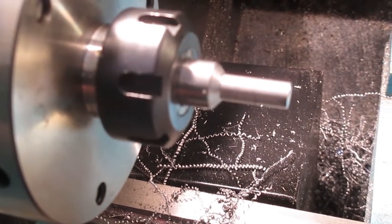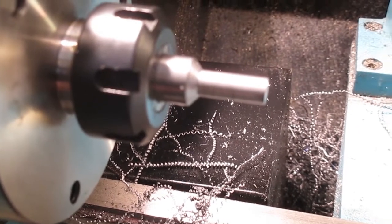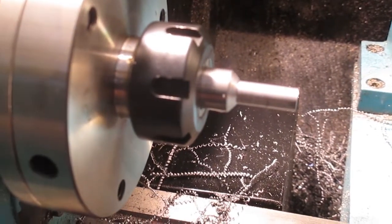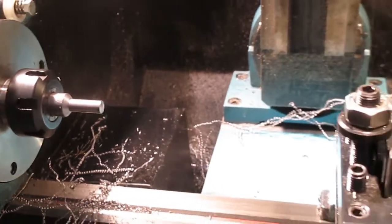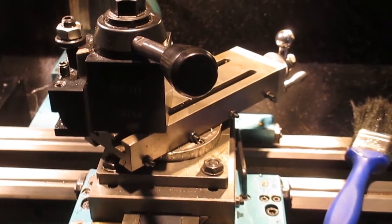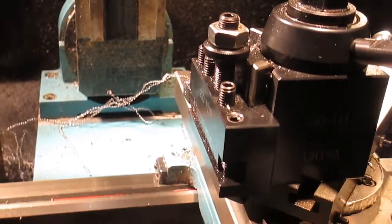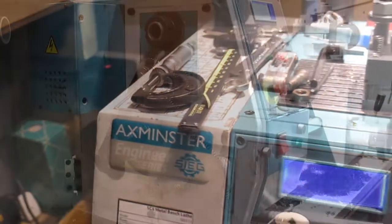As you can see, we're now at the stage where it's starting to look like a screw. So the shank is at 308 thousandths, so 4 thousandths under 5/16, shouldn't be an issue. So now we just need to cut the thread. So we'll be changing this angle here to 27.5 degrees, change the cutter out for a 55 degree high speed steel threading bit, and we'll get in there to change the gears. So I'll get all that open, get the gears ready, and I'll bring you back.